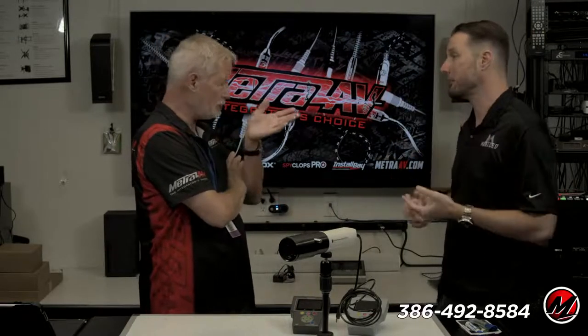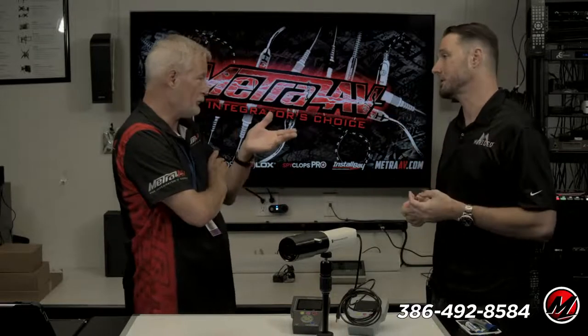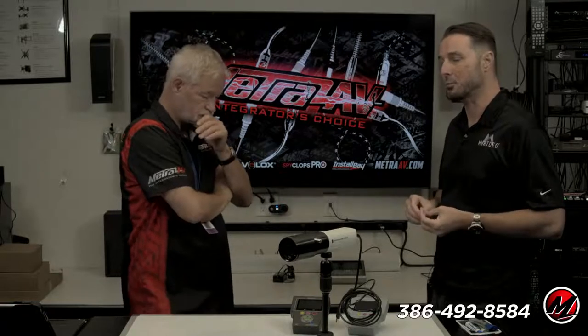That's going to bring up an EDID menu. Push up or down until you see an HDR EDID, then press number one again. I hear him clicking, and I hear him go, okay, cool, we're good. That was at like 8 o'clock West Coast time, which is 11 o'clock your time. But that's what you have to do. You're working, he's working. Right, exactly. So you do have to be there for people, and I get it.